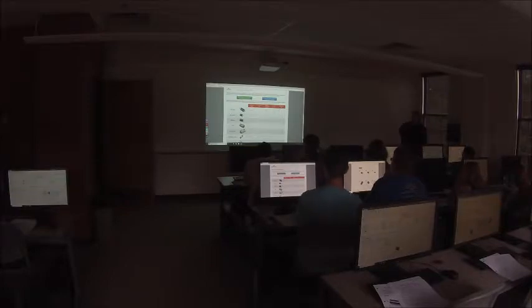Typically with motors without any gearing, the stall torque's low. It's not high enough to really do anything useful. You have to gear the motor down before it's really good for anything. So that's free load speed and stall torque.